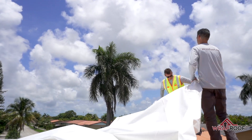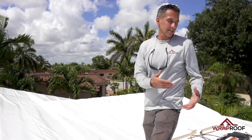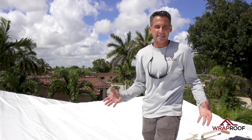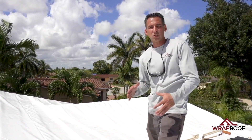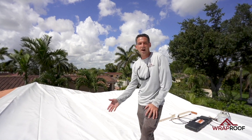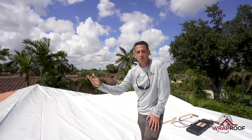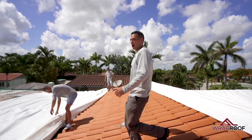That can be prevented by doing a vertical seam. However, if you do a horizontal seam — like in this case — there are two flat sections on this roof. When you have a flat section, you never want a seam there, which is why we're doing a horizontal seam here. This is a three-pitch roof, so it's completely fine as long as you're over the ridge.